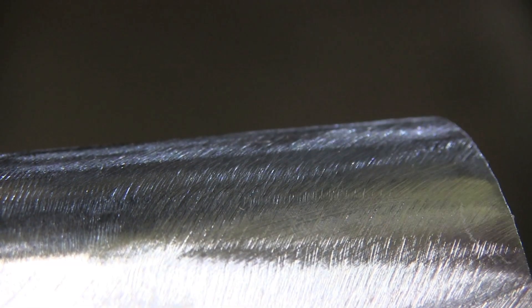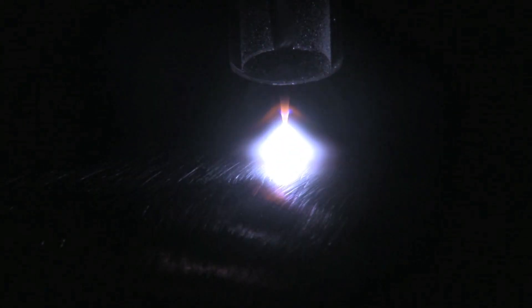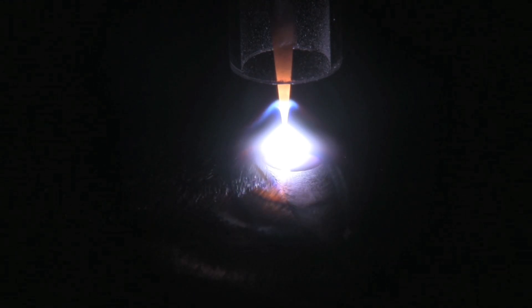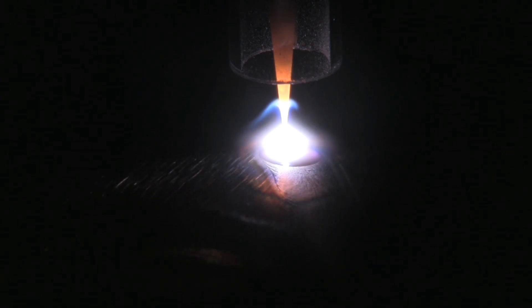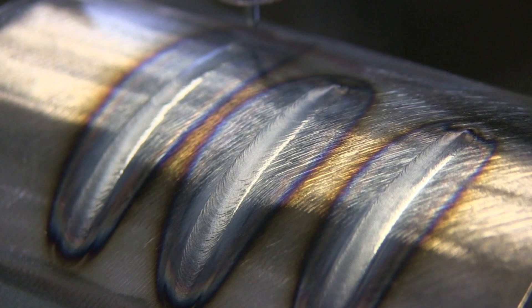Lastly, the needle-sharp electrode. This is actually a very useful taper if you need to weld something thin and you don't have the right size electrode. You get a really crisp start and a really stable arc at low amperages, even if you're using one or even two sizes too big an electrode. I've seen box cutter blades welded with a 1/8" electrode with the tip tapered way back like this and even polished to get a good start.